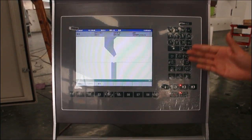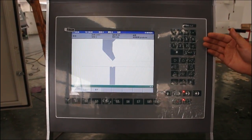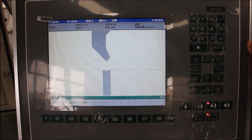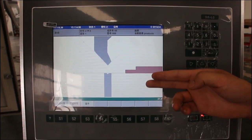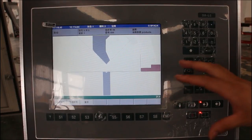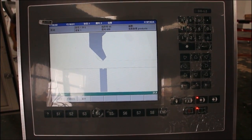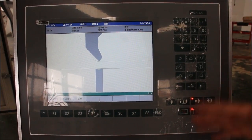This is a controller of EA63. It's a Made in China brand controller. It can control four axes: X, Y1, Y2, R axis, and the crowning axis. You can see this is a 2D screen — it's a very big one, easy to operate and understand, easy to program. The keys are very easy to understand too. It also has an English version and English user manual.